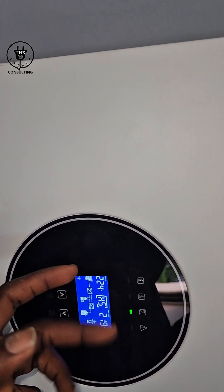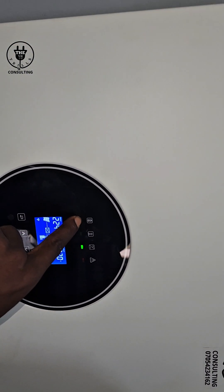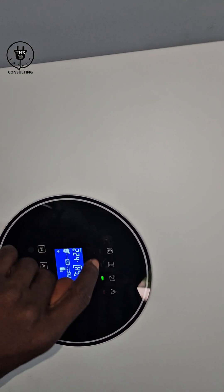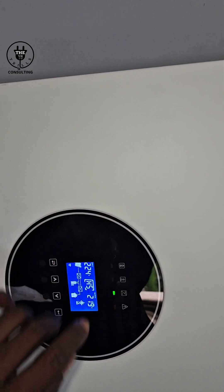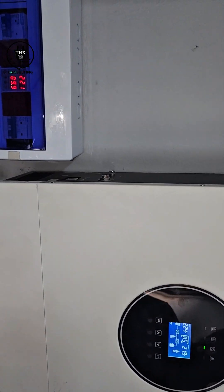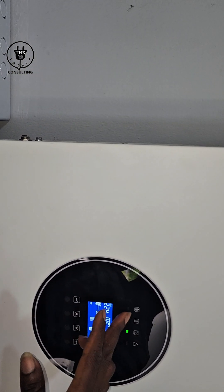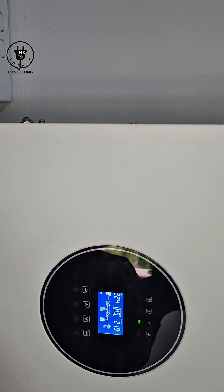The indicator light shows charging status: when it's blinking it means it's charging; when it stops blinking it means it's not charging; and when it's on steady without blinking it means the battery is full. It doesn't indicate when the battery is supplying power — when the battery is supplying it will still be on. Right now the battery and solar panels are supplying, but as you can see it's no longer blinking, which means the sun power is not enough to charge it.